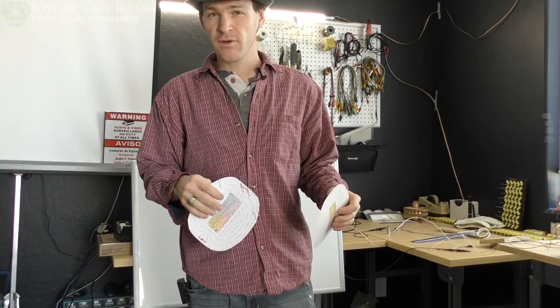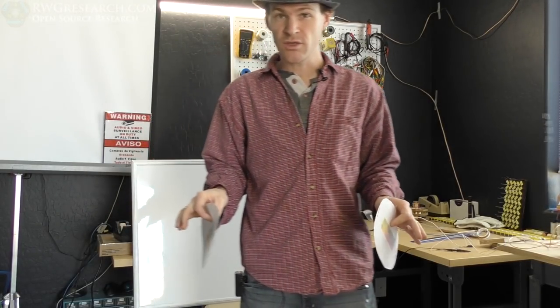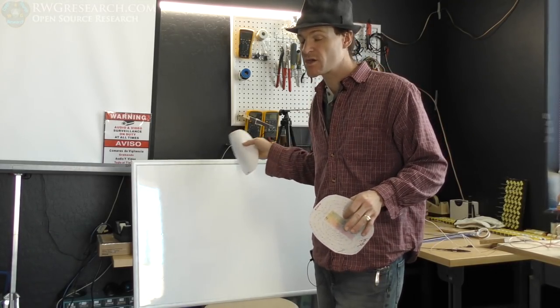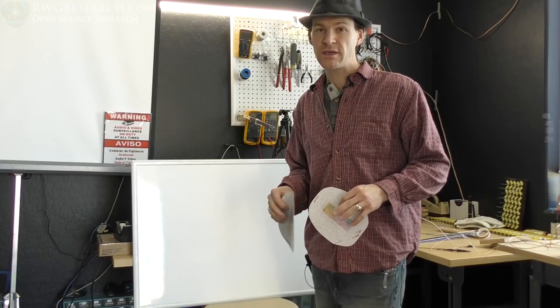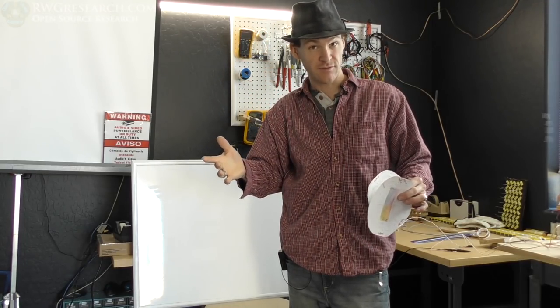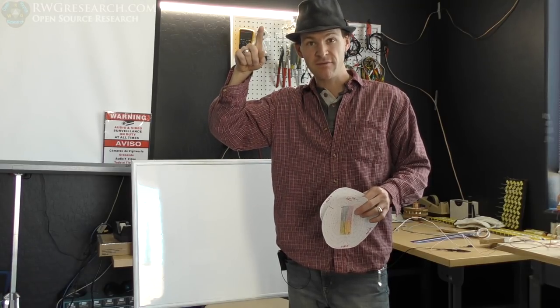So it's a bit different. We're only going to be looking at voltage today. We're going to be looking at traces on the oscilloscope and the voltage induced. We're not going to worry about current. All we care about is, depending on if the current is going in one direction or the other direction, the voltage is on the top of the zero line or the bottom. That's very simple. If the voltage is above, it's going one direction.